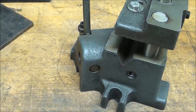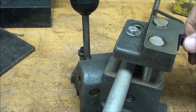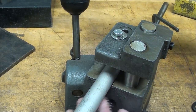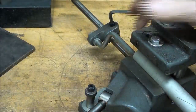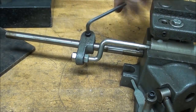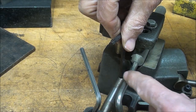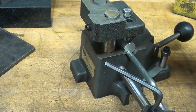What I do to adjust it is simply put the stock in there — this is aluminum — and tighten it right here. The cam should be in the up position for that. Now move the work in and out — take it out, put as many pieces as you want, and just clamp it right here. The work is secure and notice that I'm up against the stop. The stop can be moved in and out on this rod, and they even provide a hole right here to allow you to tighten it. It seems like they just went the extra mile with all of the details and quality. And I am not one of their representatives — I just like this product.